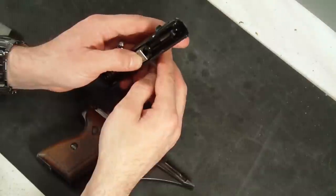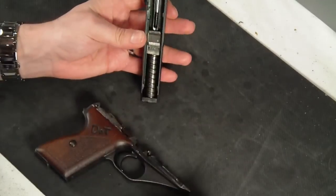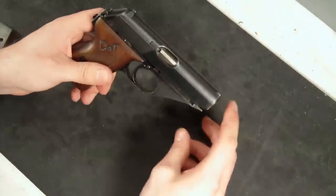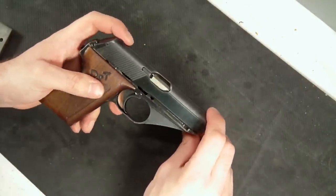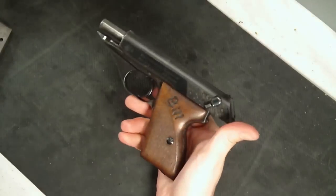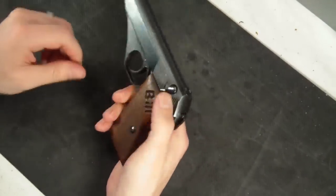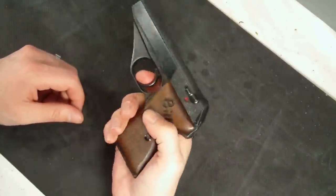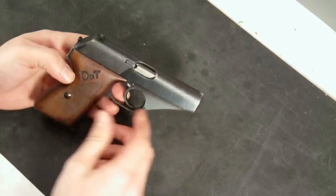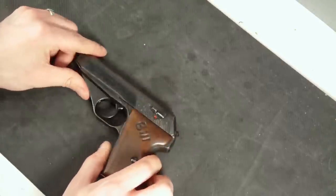You just have to be able to get the spring in there somehow, and then eventually it should be a matter of just pushing it down into the original position. Once you've got everything assembled, you can simply put the top right back on - just forward of the full original position and push down and backwards a little bit - and it pops right back together. At that point the gun is reassembled and you can test it. Make sure it works - looks like it does. Test the action, trigger - everything seems like it's working. So a pretty cool little gun: the Mauser HSC 1943 4th variation. If you guys have any questions feel free to let me know. Otherwise I hope you enjoyed, and thanks for your time.